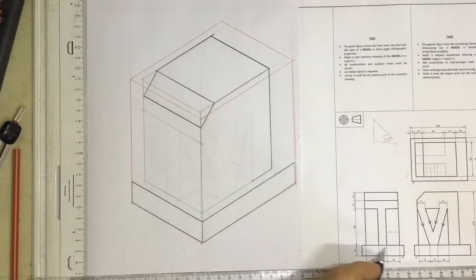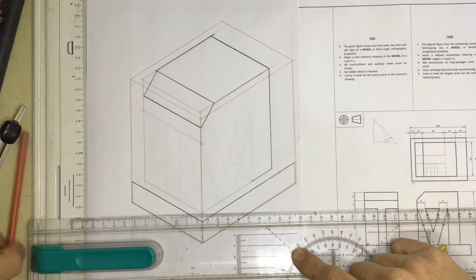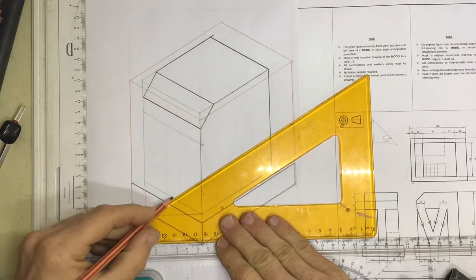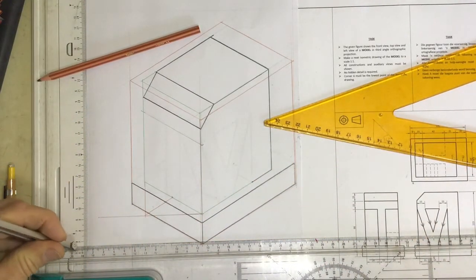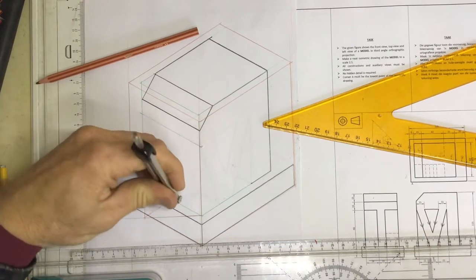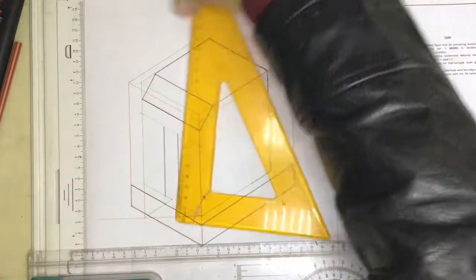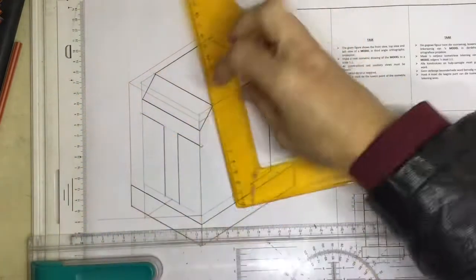It says that I've got 15 millimeters in the middle. I want to find the exact middle — I take a line going across from the corner, another line across like that, and a line going back at 30 degrees. That'll give me the middle. I measure off 7.5mm on either side of that, mark it off on each side, and I know it's exactly in the middle. I can then draw a line up to my construction line on each side and darken in that detail, finishing it off with lines coming down.